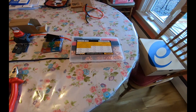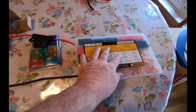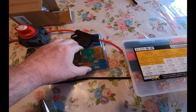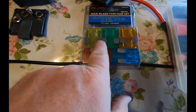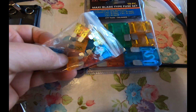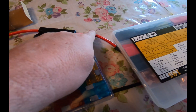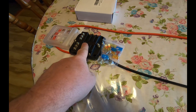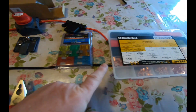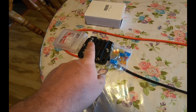We've got everything set up here like a little schematic. We go from the battery positive terminal through our fuse — this is a maxi blade type fuse holder, and here are the maxi blade fuses; they're really big compared to the little ones. That's an 8 gauge wire going into the switch, 8 gauge wire coming out into the fuse block. From the negative terminal of the battery we bypass the switch and go right on over to the fuse block.